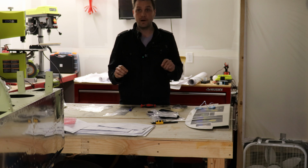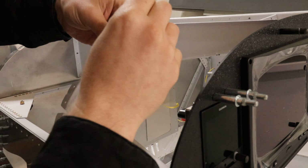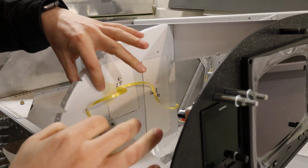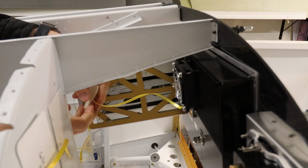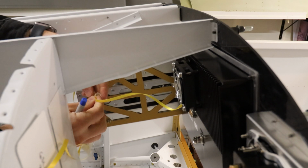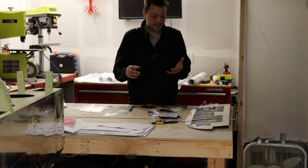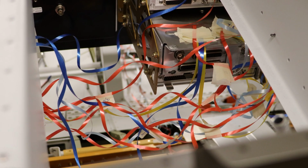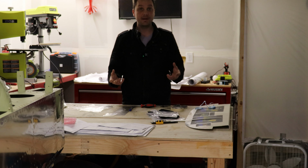When I get a little cooped up on the wiring diagram, I'm actually coming back down to the garage running some fake wire. I've bought a huge assortment of colored ribbon, and I figured if I can run all this ribbon first, it's going to do a few things for me. It's going to show me where I need to accommodate wire runs. It's going to show me how much wire of each type I need, and it's going to help me kind of troubleshoot before I start crimping connectors. I've tried to make it so I have a color for each. I have a color for coax, I have a color for serial, I have a color for CAN bus. Eventually, we would get sort of this makeshift wiring harness that I can pull out of the plane for dimensions and also layout, and then start to replace those ribbons with wire.